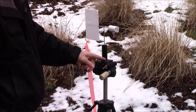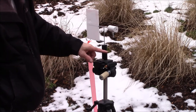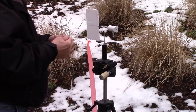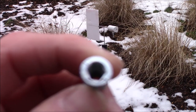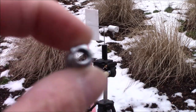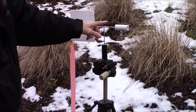Basically, here at the top plate there's a quarter-20 screw. I put a new one in to extend up further into this dowel. I tapped the dowel with a wood fastener with internal thread, and there's an Allen wrench to set it — inside it's quarter-20.